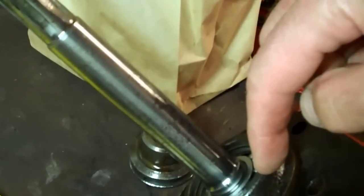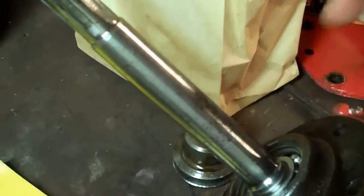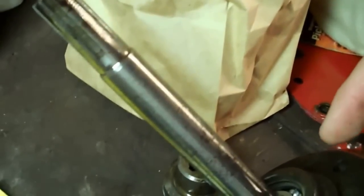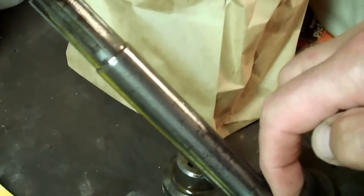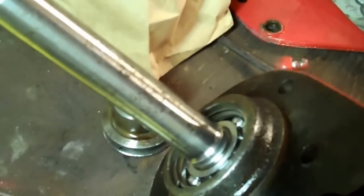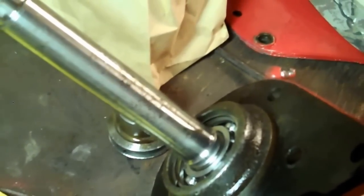A couple of the causes could be that the bearing in this area and the clutch plate housing could have moved. But I can see that it did not. The retaining ring is still right in the slot where it should be. The one thing I did notice was that there should be some sort of retaining ring on the inner bearing race, and there is none. However, the slot where that ring is supposed to go appears to be exposed right where it should be, further indicating that the shaft has not moved on the bearing. So I know that that is not the reason why there is such a large space between the butt ends of these two shafts.